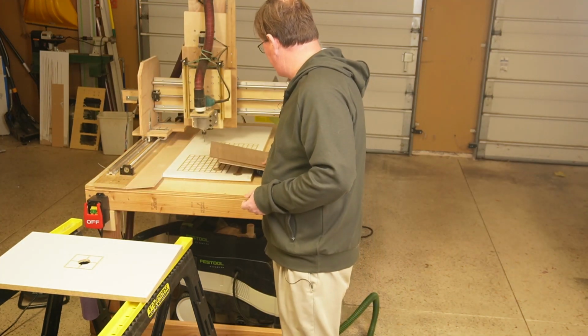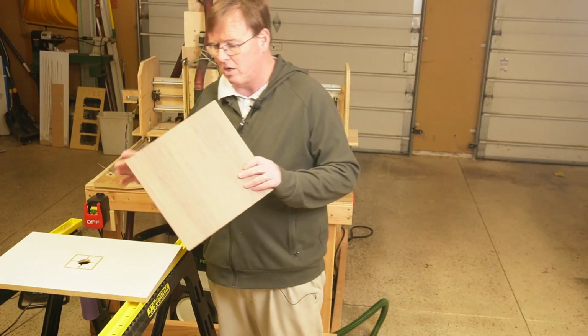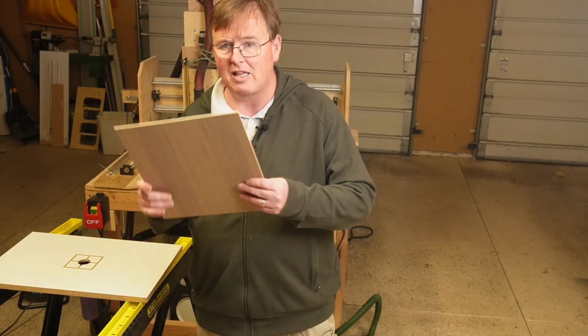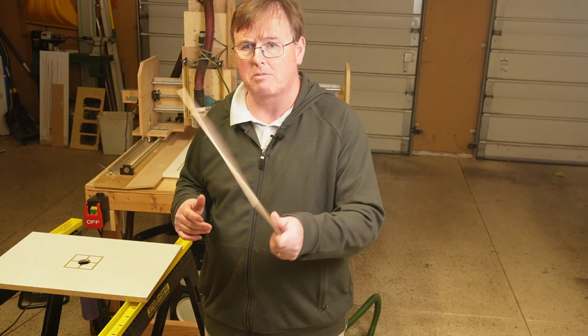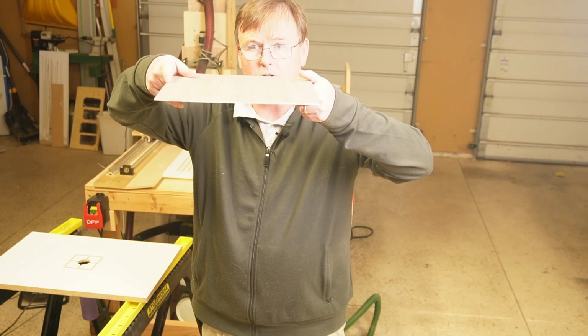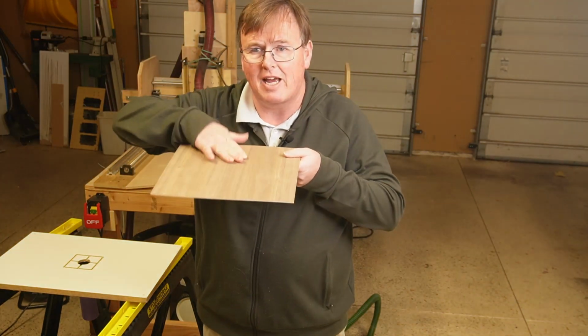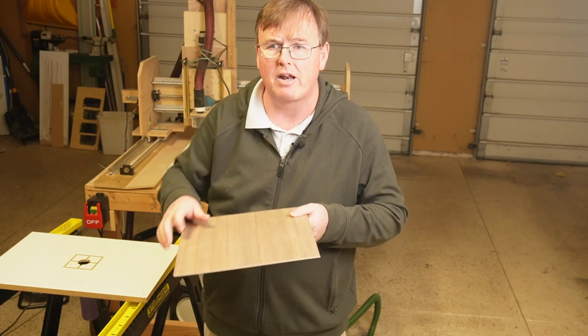What about if you wanted to machine something like a 1/4 inch, actually, it's probably an 1/8 inch laminated piece of plywood. This is really inexpensive to buy, but oftentimes they have a bow in them. It would sure be nice to have a vacuum table so that we could pull that bow out, so when we're V-carving, we get a nice flat surface.